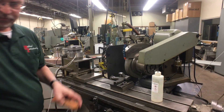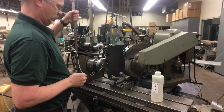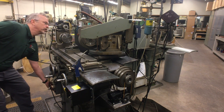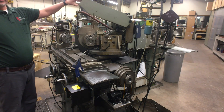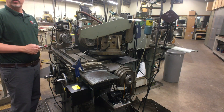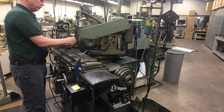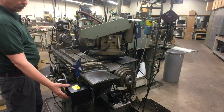Okay, indicator over here, tip it down, put the belt on, and we're ready to grind. We're ready to dress the wheel, so I'm going to start up the wheel. We've added a few things to this — instead of the original spindle, we have a four-inch blockhead driven by a belt. Around back I put an inverter drive on so that we can get a nice, smooth running wheel. In order to get the smoothest dress I can get, I'm going to use the table drive here, which we've modified a little bit.